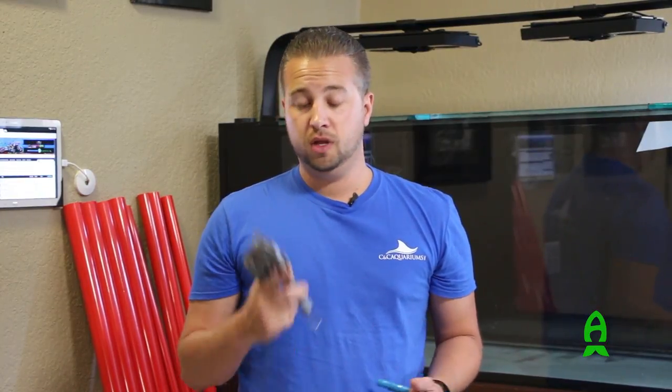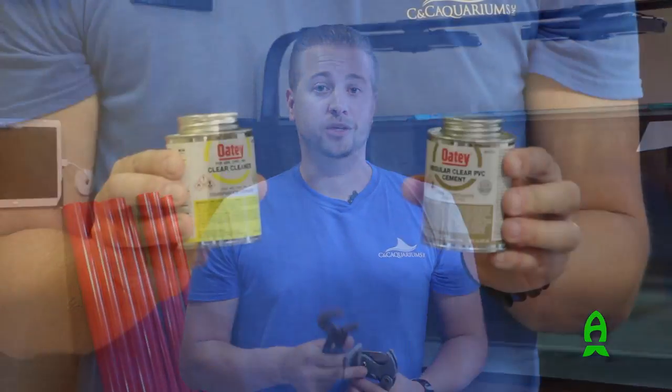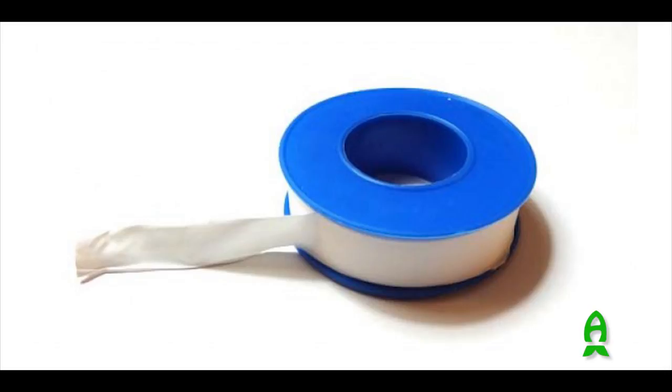After PVC parts, you've got to think about tools. You'll need PVC cutters — very important. You can use a hacksaw, which works well and gets clean cuts, but you'll spend all night hacksawing. The PVC cutter gives you a nice, accurate cut. It's a decent investment if you're going to do any PVC work. You'll also need a decent-sized wrench to get that bulkhead that quarter or half turn extra tight, as well as for threaded fittings and barb fittings.